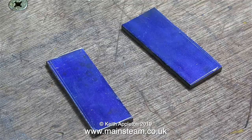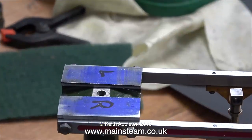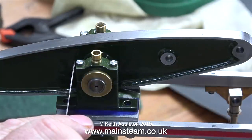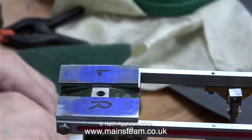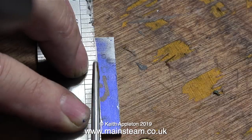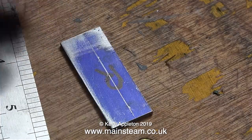The next part of the job is to put these two pieces of metal in the milling machine and cut them both to exactly the same size. Time to fit them onto the top of the column — I've marked a left and a right so I know which way around they are. This part of the job is critical: making sure the beam is in the middle. By measuring the position of the beam from both sides, this shows me where I need to drill the holes to mount the beam bearings, which turns out to be five sixteenths of an inch from the inside edges of both pieces of steel.